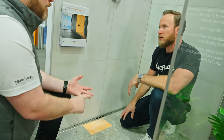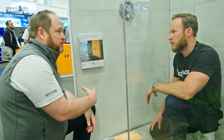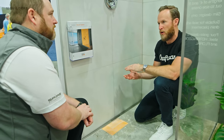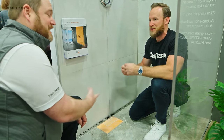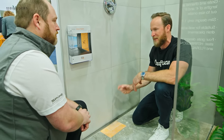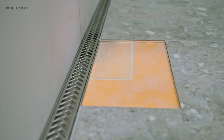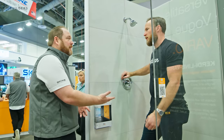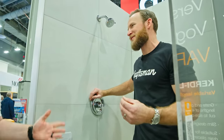This kind of foolproofs the install — if the plumbing is slightly off or there's a joist in the way, you're not moving that joist. You have the flexibility to just buy the appropriate size drain and cut it to fit, without getting into framing engineering or having other trades come back to move things. In terms of waterproofing layers, your waterproofing layer is still the KERDI with the flange — this here is just your finish. Basically it's another tile that happens to allow water to flow through it. It's also much narrower and sleeker — people don't want to see the plumbing features, they want the beauty of the tile to shine.